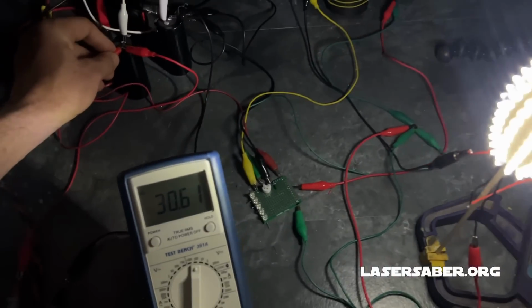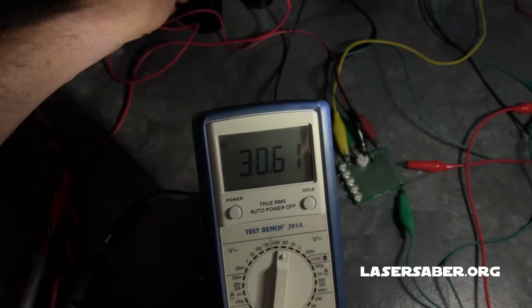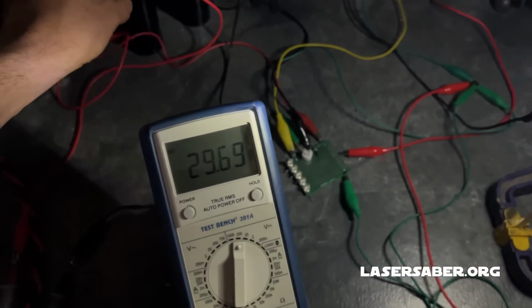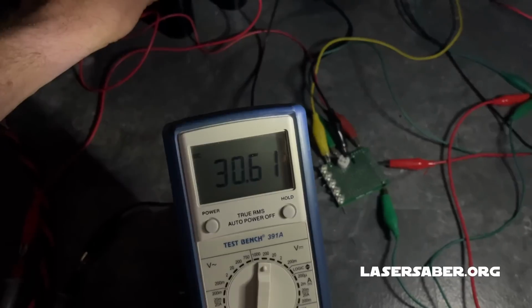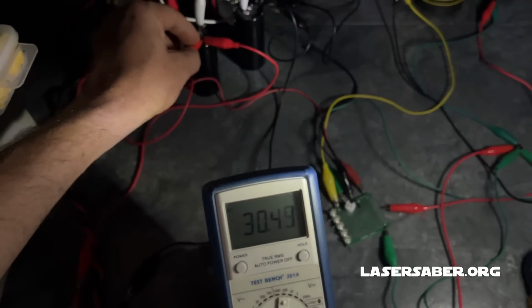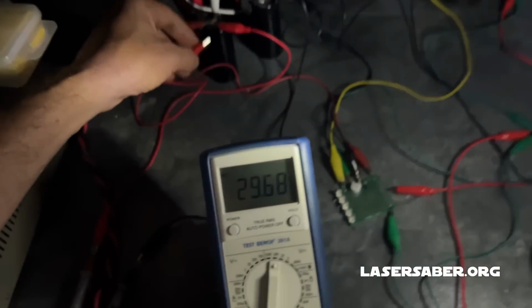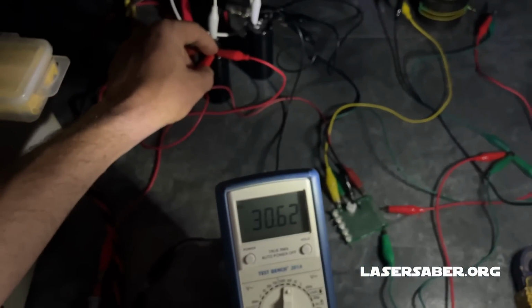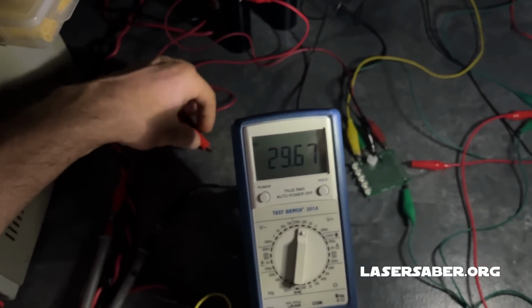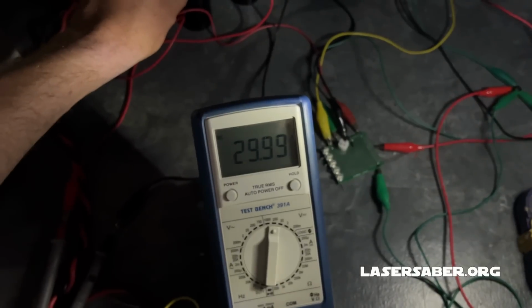Now this transistor does not do it as strongly as the transistor that I first discovered this effect on. I only had one of those and it blew out yesterday. So now I'm just testing some of my other transistors, and none of them showed this effect except for this one right here. So it's not a very big effect on this transistor, but when the others come in that are the same specs as the one I had yesterday, hopefully we'll see the effect. Yesterday I was getting 5 volts or more of climb after removing the power supply to the electrolytic capacitors. And very strange effect. I've never seen anything like that before. All the SGR-L circuits I've ever made, when you remove power to the capacitors, they just immediately run down, or they might hover for a while, but they always just run down. They never climb up in voltage like you see there. So very interesting, and I'll keep experimenting with this and see if I can't get to the bottom of it.